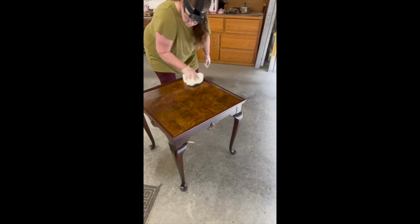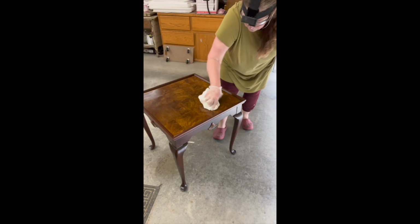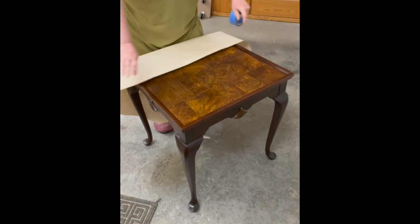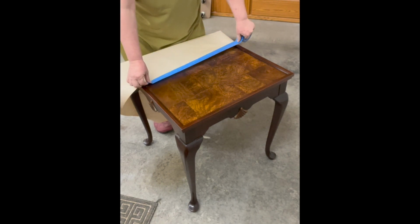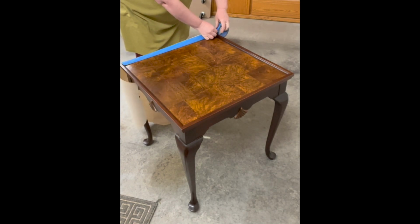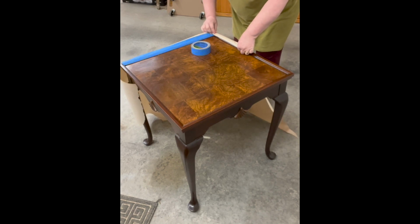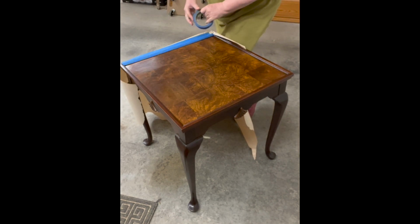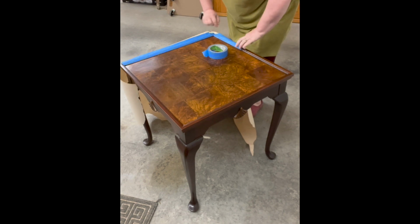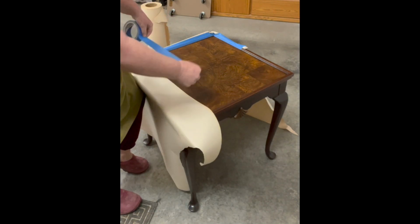But of course, Howard Feed and Wax, it's very easy to put on top of anything. And we did have a little debate on my channel about that. And Restore a Finish, I keep on getting them mixed up. The Howard Feed and Wax is like a polish. So if you are going to use it on something that's used all the time and you clean it off all the time, well, first of all, you're supposed to wait 30 days to make sure it's 100% dry. Then, if you use it on a coffee table or a real dining room table, you need to polish it every once in a while. So it is not like a poly coat. But even those, after a while, you need to polish, really.